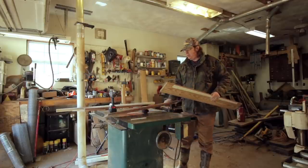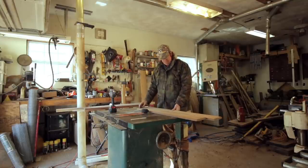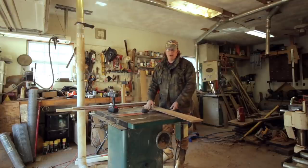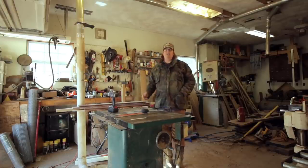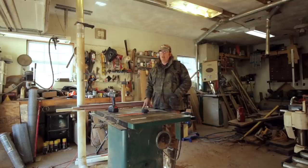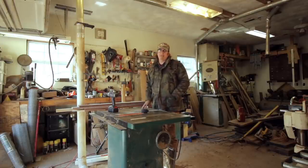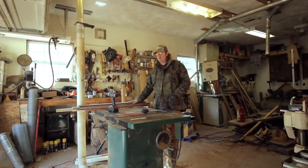My plan is to use this tongue and groove material since it'll fit together nicely and not have a lot of air gaps. Now you can build it out of anything. Plywood would probably be the easiest because it's a sheet material — you can cut your angles and lines. The thing to consider is how that plywood is going to weather; if it's not outdoor grade it'll start to delaminate. The pine will hold up better. I'd definitely stay away from OSB — that stuff really delaminates with sun and weather, and it's full of all kinds of nasty glues I wouldn't want around my seeds.